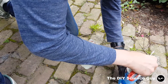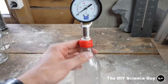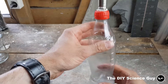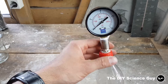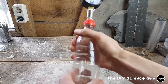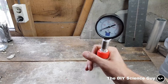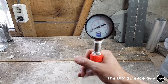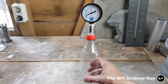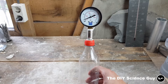That's enough for this experiment. The pressure of the butane is just zero bar because it's still quite cold — about minus 3.5 degrees Celsius. But when it warms up it slowly starts to gain pressure. If I shake the bottle I force it to evaporate, it starts to cool down, and as I warm it the pressure slowly starts to rise. At about 22 degrees Celsius the pressure should rise to about one and a half bar — and indeed it's just a little bit under one and a half bar, which is what's to be expected.